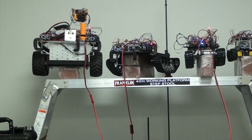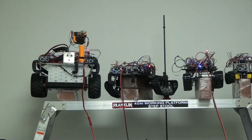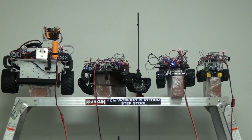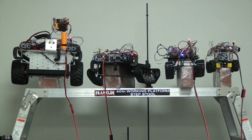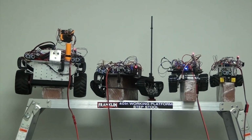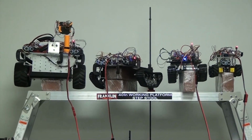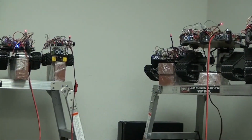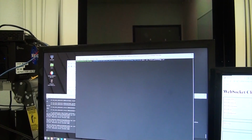And what's going to happen is we're going to start the frontline Java server application, and it will make connections to each robot, and then all the robots will be available for a Java application to connect to each one individually and control them all in one application, or you can have individual applications just controlling one at a time. Doesn't matter. Because they're all networked, we can have one application that has visibility and control to all robots, so you can develop some pretty interesting and intelligent applications using multiple robots, in this case the Rovers, as shown.